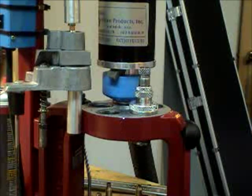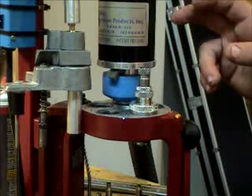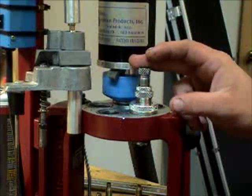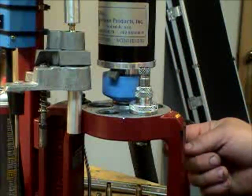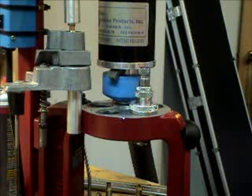But we only need two things on the end. The Dillon does a pretty good job of cutting the cases. I like running — even if I'm doing 223 — a die after the trimmer, which ends up taking the burr, anything that's a burr or left on the cases gets taken out with the sizing die. And then by the time you run it through the stainless steel media tumbler, you end up not having to chamfer or deburr the cases.